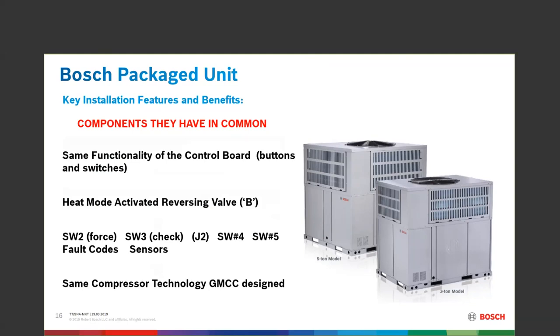SW44 is the switch that lets me change the logic of my indoor coil — changing from a 47-degree coil in summertime to 42 degrees, allowing a lower coil temperature. Someone asked if flipping that affects the economics of the structure, and absolutely, we're going to ramp up the compressor and use more wattage — it will affect their electric bill somewhat. I've never had anyone tell me they couldn't afford their bill after the flip; we flip it to make them more comfortable. I call these 'callback switches' — leave them alone until somebody calls saying they're uncomfortable.